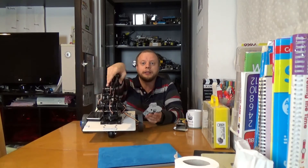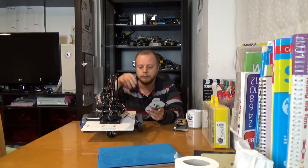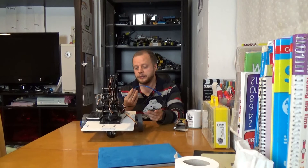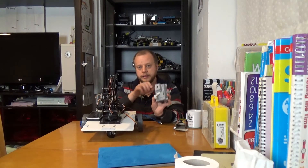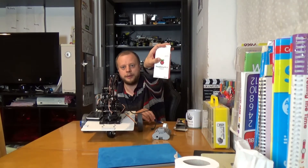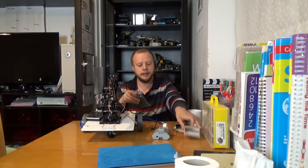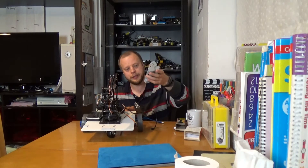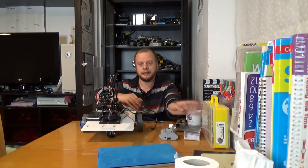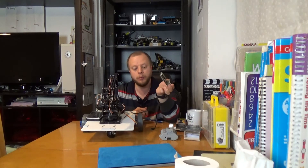The ultimate goal for me would be to get this arm navigating and grabbing things. I've already unplugged the I2C connections and I'm aware the cabling isn't great, so there'll probably be a cabling upgrade. Replacing with a Raspberry Pi 3 also means it'll be lighter weight because I don't need separate Wi-Fi and Bluetooth dongles — it's got them on board — and it's just a more powerful, gruntier setup.